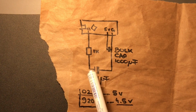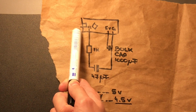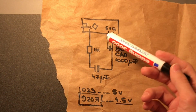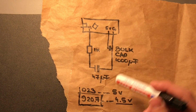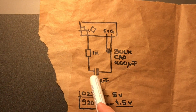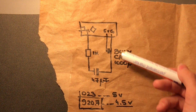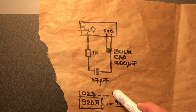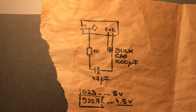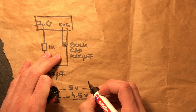But this isn't going to power anything. This is only connected to an analog pin that is either feeding it or reading it. And if it's reading it, it's like 1 mega ohm of resistance. So nothing is discharging this cap, ever. Just its internal resistance, whatever. So the moment the system power goes down, this 5 volts that represents 1023 is going to go down, right?